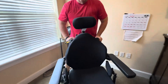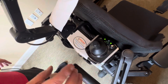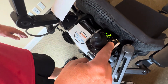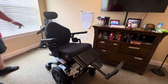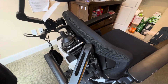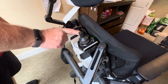We're going to come back to the controls and press the power button on this controller. As you can see, because the wheels are locked, the joystick does nothing to move the wheelchair. But if we press the M button two times, it will now allow the chair to recline upwards. Now gravity is forcing Hal backwards instead of falling forwards out of the chair. Once you're done adjusting, you can turn the power off to conserve the battery. When it's time to get him out of the chair, turn it back on. It will come back to the last mode. You may have to cycle through until the chair is lit up green — that's what you're looking for — and that will allow adjustment.